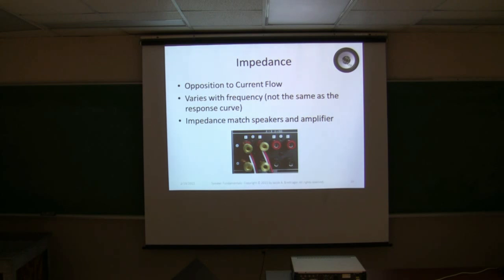We'll show you a response curve in a minute so you can see what I mean. Most home speakers are 8 ohms — that's probably the most common. Sometimes you'll find a 16. If you have a car speaker, it's probably 4 ohms. Bose did something really interesting in vehicles — they have half-ohm speakers, and every speaker has its own amplifier in the door. Impedance matching speakers with your amplifier is extremely important. If you have an 8-ohm speaker, connect it to the 8-ohm output. If you put two 8-ohm speakers in parallel, you can connect them to the 4-ohm output.